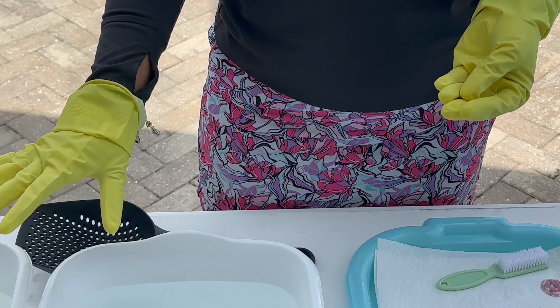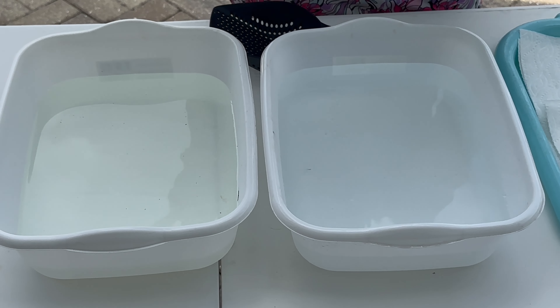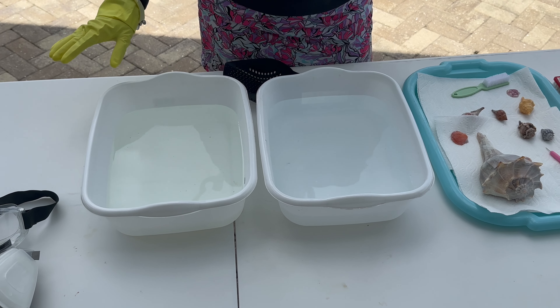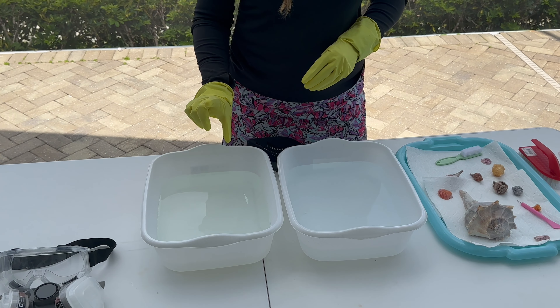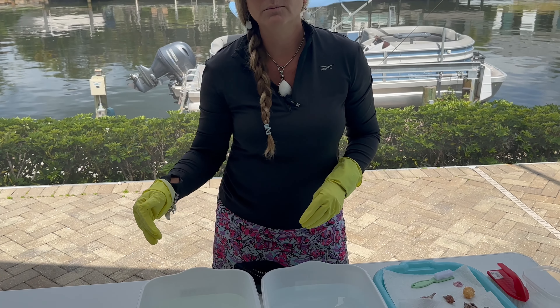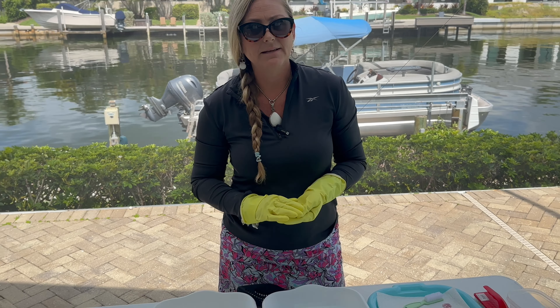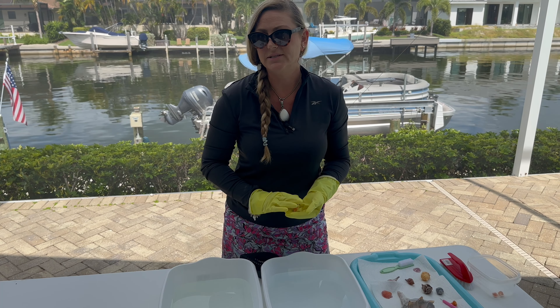Now going to the setup — we'll put the exact amounts in our comments because everybody does it differently. I like to err on the side of caution and use about a cup of muriatic acid, with the rest of the bucket filled with water. If you need more acid, you can add more as you go. I like to keep my shells nice and safe — I don't want pit holes. I dip them for three seconds.